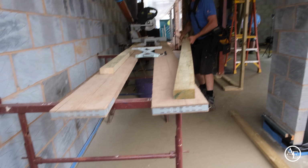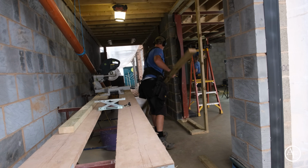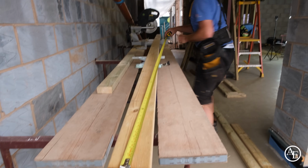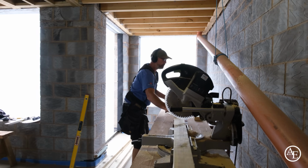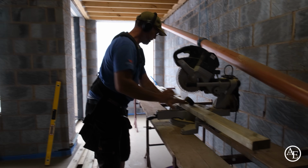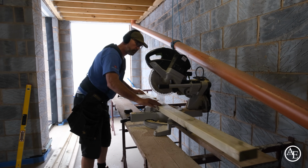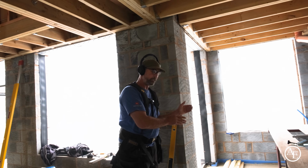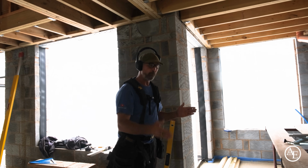Now what I will do is start spinning them straight away, because then when I drag them onto the saw, they'll be ready to go. This will be 3 meters. I'm just checking there's no sawn crap up there, no splits. I want 2.9, so I'll go 350 on this one. Not a bad bit of timber actually. The reason I'm spinning the timber is I'm cutting off any bad splits at the end, but also I like to make sure I've got a nice clean cut both sides.